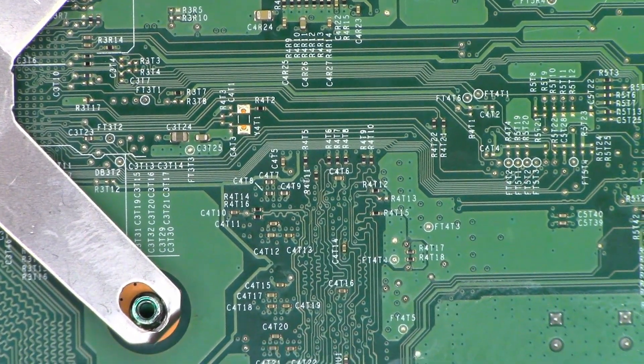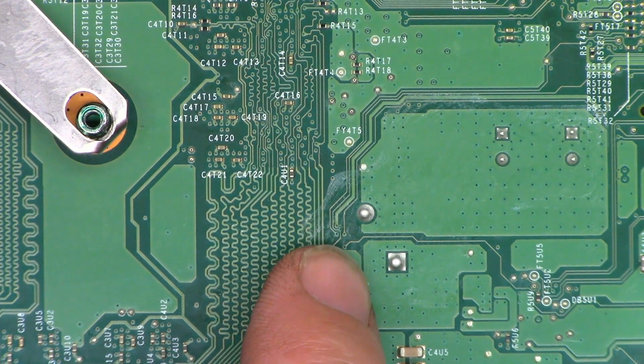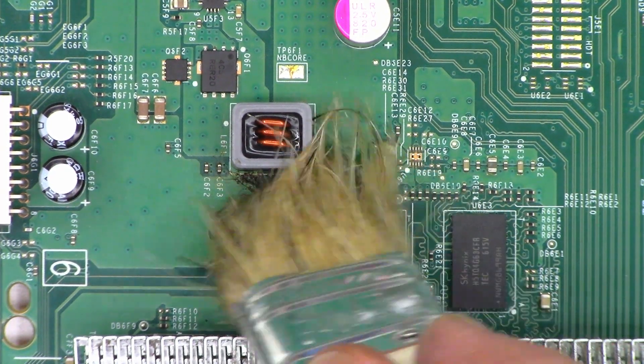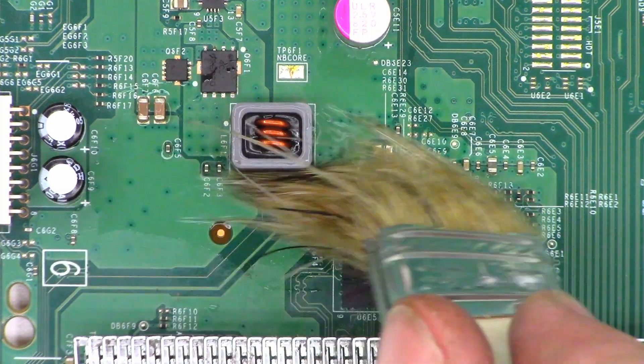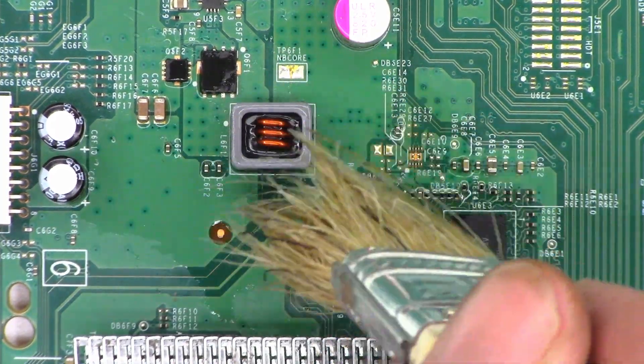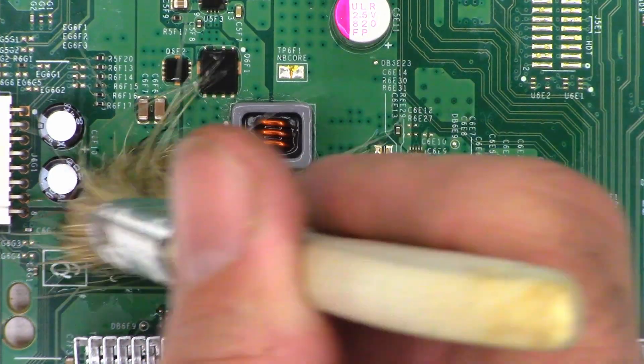And if I come down here, right here is where the big coil mounts. And these are the plate-throughs that may have been damaged by the corrosion. So I'm going to try to clean this off a little bit. I'm just going to start with just some regular water and a paint brush — it's moistened but not soaked in water. I'm not really worried about damaging any of the components because it doesn't work as it is, but that is the only defect I can see on the whole board.